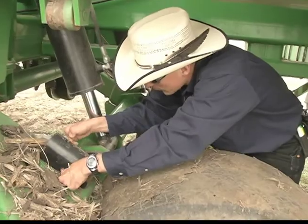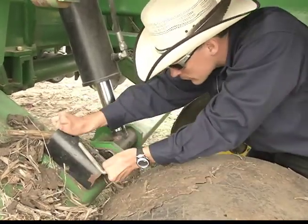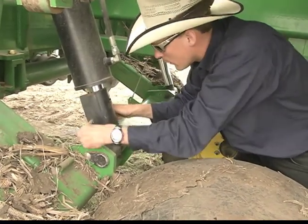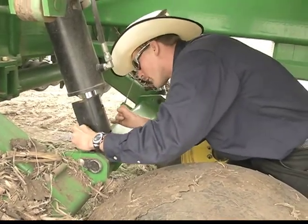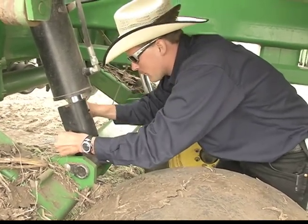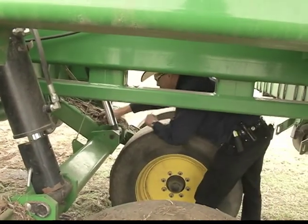the debris out of the way, there's a little hitch pin clip on the back side. Pull the pin out, take the safety, slide it over top of the cylinder on the rear main frame carrier cylinders. Install the hitch pin clip in the pin and do the same for the other side.